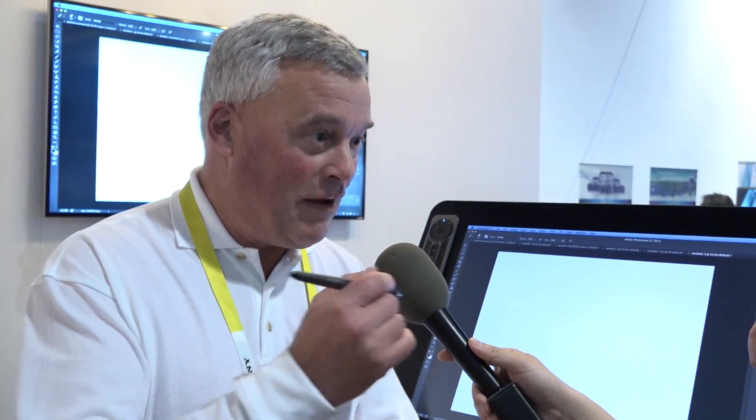We do a lot of things with our creative pen displays, the Cintiq. We have our technology called electromagnetic resonance technology, or EMR technology. It's built in behind the LCD, and like any digitizing technology, it is a grid pattern. The grid pattern is fairly tight and gives you a very accurate result when using a pen. One of the cool things about Wacom pens: there are no batteries in our pens. The EMR board actually powers the pen through capacitors inside the stylus. Pressure sensitivity is very important to creative professionals — we have 2,048 levels of pressure, and it starts recognizing pressure at one gram on the screen. Super, super sensitive.